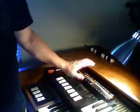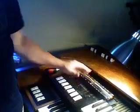Now that we have all the drawbars taken out and the pegs up top in order, it's time to take off the top part of the assembly so that we can clean the bus bars.